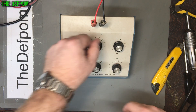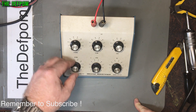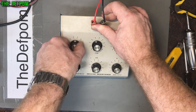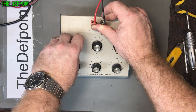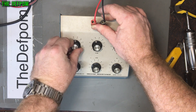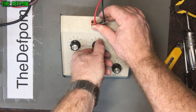I've got them all set at zero and I'm currently reading 43 ohms, so that's not the best. I'm going to have to give this a bit of a clean or something. It's jumping around a bit - 30 ohms, 100k, 201k, 301k, 401k, 501k, 601k, 701k, 800 and something. Jumping around a little bit because of the dirt - I think this needs a clean. There's a bit of dirt in here and it's affecting these readings.